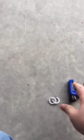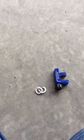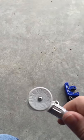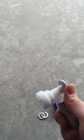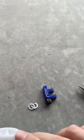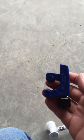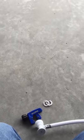I hope you guys find this video helpful. I wish I'd had a video like this when I was looking — I actually had to reach out to the manufacturer, and I was quite frustrated. The only two videos I found all said you can twist these lines off, which is incorrect if it's on that plastic line. In that case, you just need to cut it — very quick and easy as long as you have the pipe and tube cutter, which is only about nine bucks at Lowe's. Hope you guys find this helpful, and I'll talk to you next time.